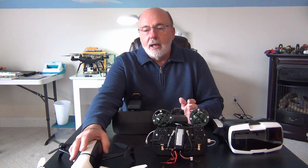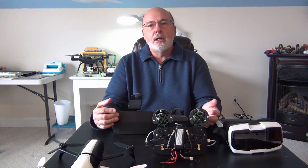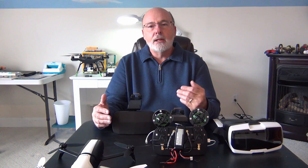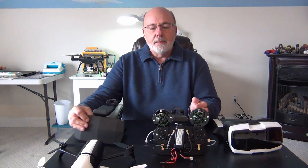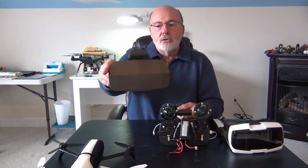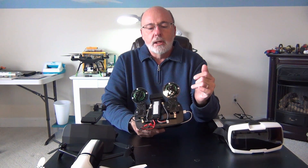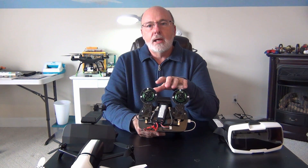I was very happy to see that. Let me go over exactly what I did. This is for people who maybe don't have the money to buy the full system from FPVLR but still want to get a little bit more out of their system. What I did basically is — as you can see here — I took a standard controller and modified it with two four-watt amplifiers, and I'm using two antennas from FPVLR.